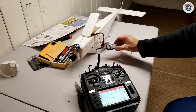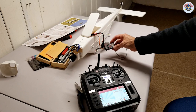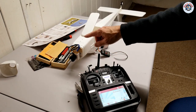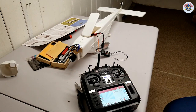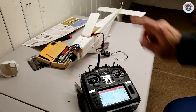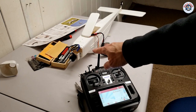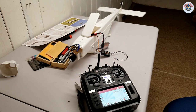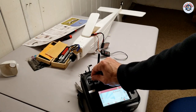I installed my Assan X8R 6-channel receiver, and everything's connected, and I bound it to my Radiomaster TX16S and set up the model. All is fine. If you are wondering how to bind the Assan receiver to the TX16S, I'll put the link down in the description. Anyway, the motor was rotating backwards, so I swapped two of the wires, and now it's all good.